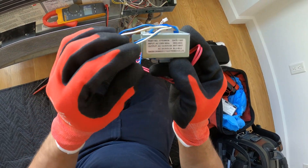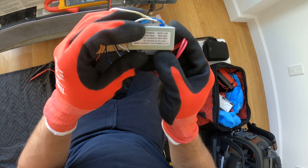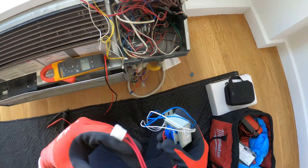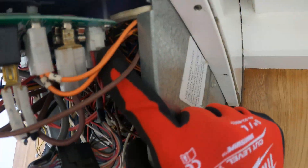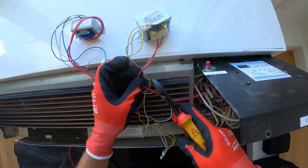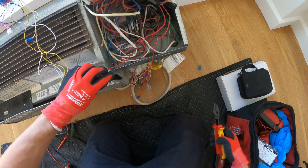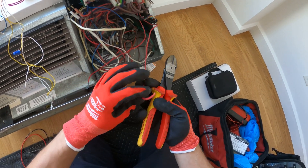Here I have another transformer. The input is the same: 208 to 230. We have 12 volts on the white and white, and 24 on the blue and blue. The only thing different about these are the actual connections on the board. What I'm going to do is keep all the connections on the board and then splice them. Right here is our 208 input — let me keep those wires long. By the way, I turned the power off. Let's splice this and connect it with that transformer input and make sure we have the output voltage to confirm it works.